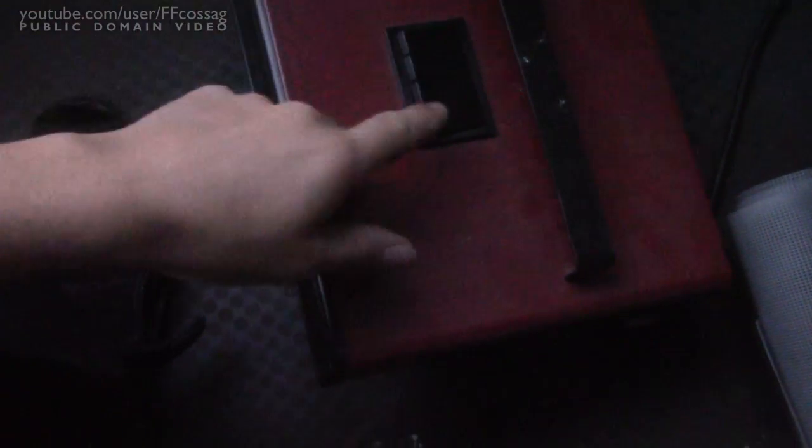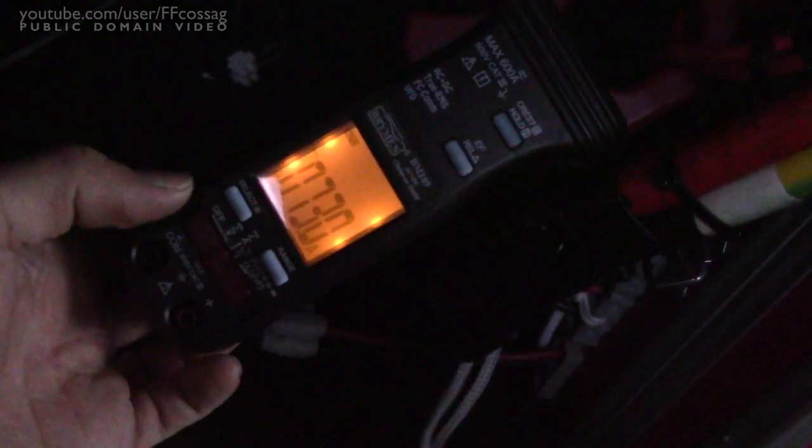Let's see if we can heat ourselves up. The clamp meter is way down there. I'm drawing 73 amps and it's getting plenty warm in here. The inverter's drawing here — connections around the back do not seem to be getting hot. Connections around the battery: absolutely fine. Connections on the box: absolutely fine. Extensions — everything seems to be working just okay.